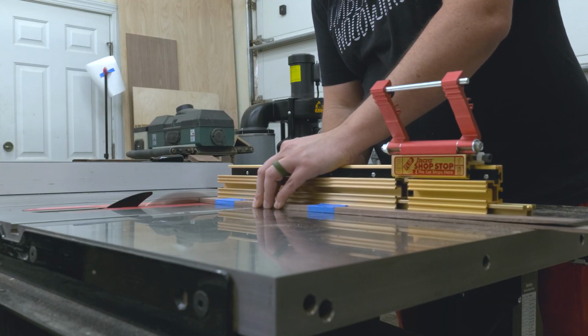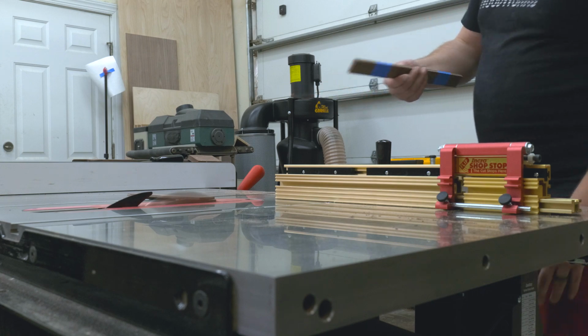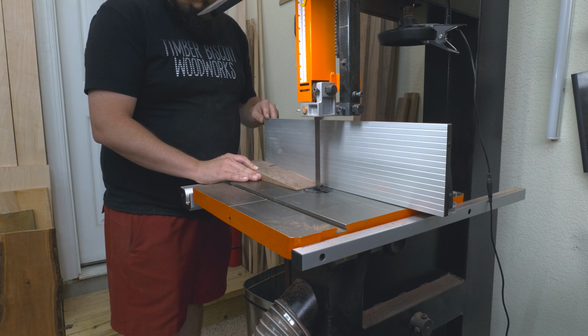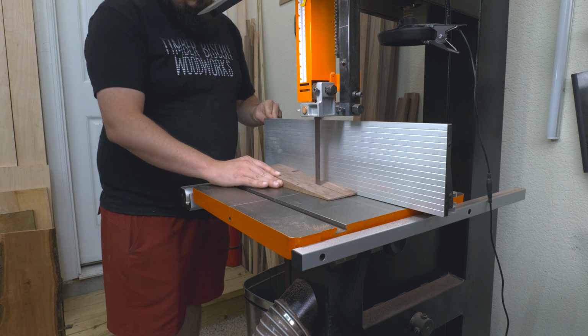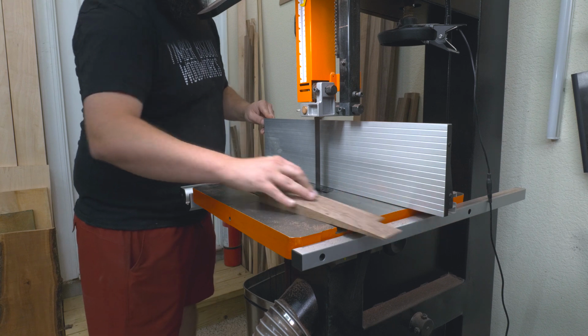So once I had them to their final thickness, I taped my 2 pieces together to ensure that they were the same length, and this will also help with the end profile that we'll do in a minute. Once I set my bandsaw fence to the width of my tongs, I went ahead and cut down that extra wedge that we had from the knife block.